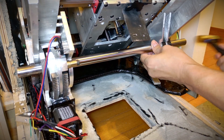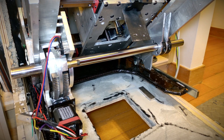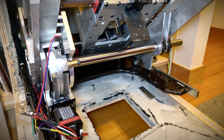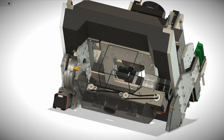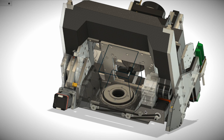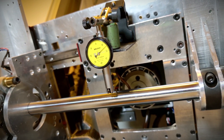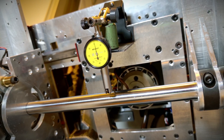This structure was part of the plan from the design stage of the machine. I knew from the beginning that without a through-shaft design for a precision shaft, proper machine alignment wouldn't be possible. But if a shaft like this is running through, how are we supposed to mount the tilting table? It seems you've misunderstood — this shaft is only used for alignment purposes. Once the adjustment is done, I will remove it.